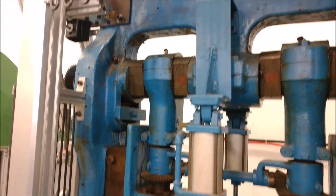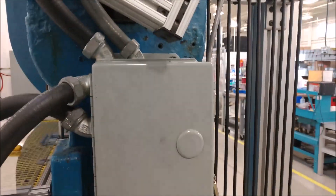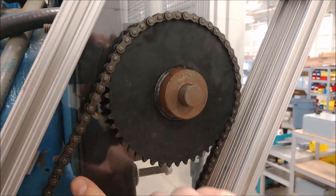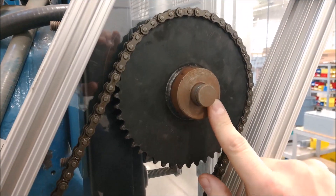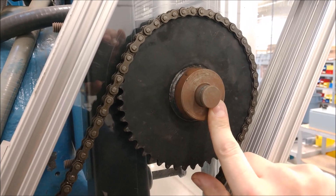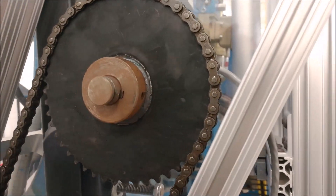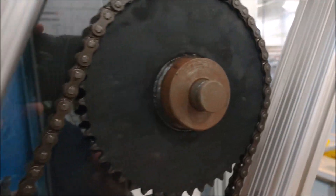Now come take a look at the resolver position. As you can see, the resolver mounting base is back here — this flat piece of metal. The keyway for the resolver is perpendicular to that mounting base, and it's vitally important that it is set up that way or it will not work. This is true whether it's mounted vertically or horizontally.